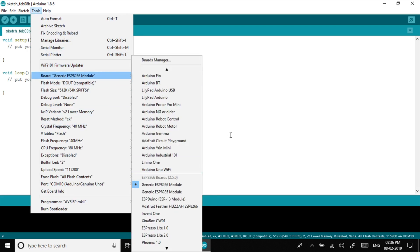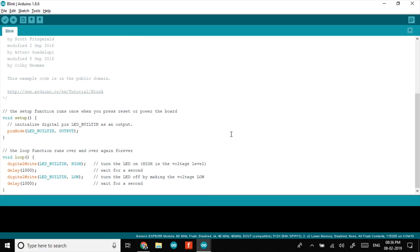The program for ESP8266 is similar to that of Arduino — the syntax and structure are also similar. Let's take a look at the program to blink the LED of ESP8266. In the program, we have set the LED pin in output mode, and in the loop, we are setting the LED on for one second and then turning it off for another second. Now upload the program as you would in Arduino by clicking this button. After the program is compiled, it will start uploading and you should see something like this.